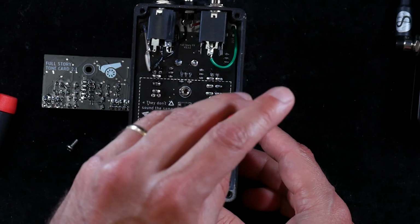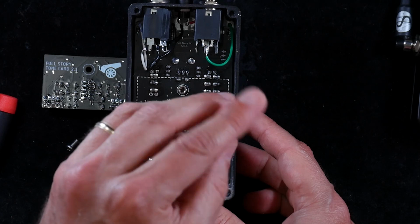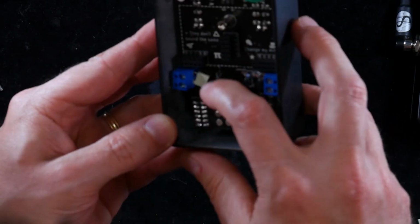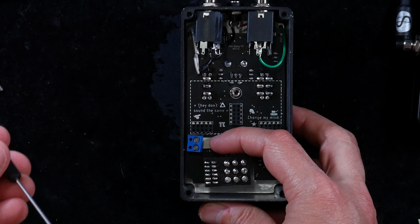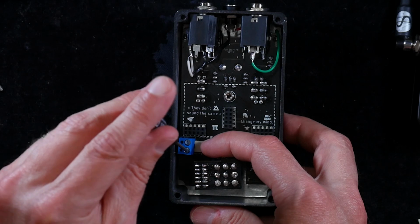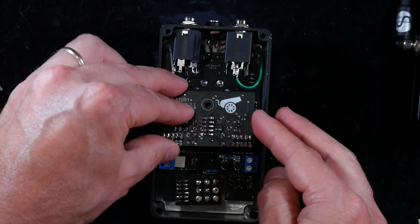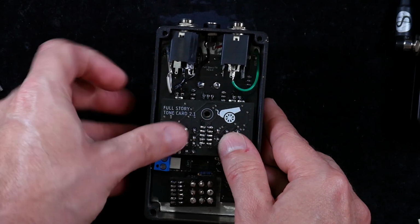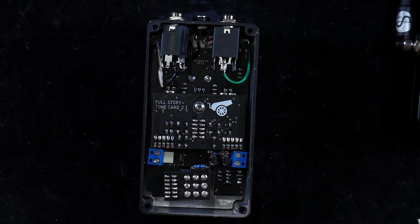Again, you don't need any soldering, you just tighten the 2 screws in the terminal block. Then it's on to the tone cap. We're going to be increasing it slightly from 3.9 to 4.7 nanofarad, which translates to more mid-range and presence. To give you a better idea, when the switch is in the up position, the value there is 20 nanofarad. Again, we're going with the Civil War, which really blends well with a little extra mid-range and the MOSFET clipping. So let's hear what that sounds like.